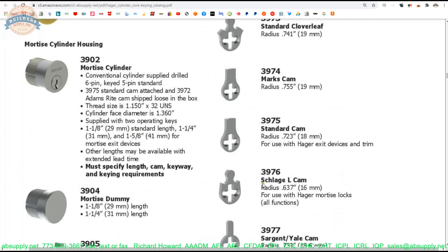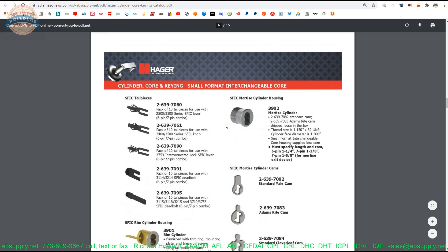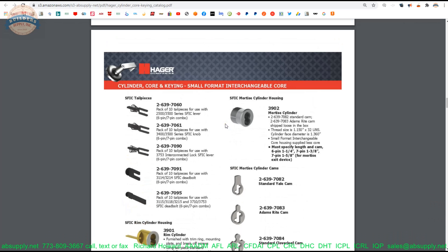It is most commonly done when you are installing Medeco into anyone else's key system. Why Medeco? Well, that is really their business. You are not going to buy a mortise lock from Medeco, although they have made deadbolts in the past. You are not going to buy lots of different lock types from them, but you will buy high-security conventional, large-format interchangeable, and small-format interchangeable cores from them. Their whole business model is getting you high-security cylinders that you are going to end up installing in other people's locks. I say Medeco only because I have heard them described as the father of compatibility — they make a cylinder that will fit in everybody's lock, because it is their high-security keying system that they are really selling.